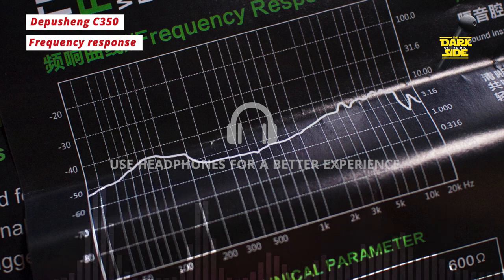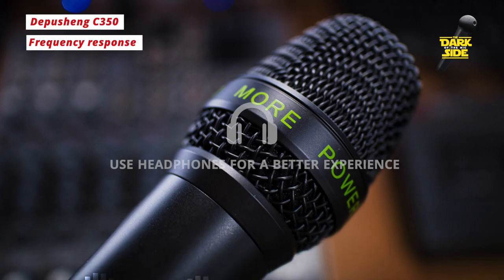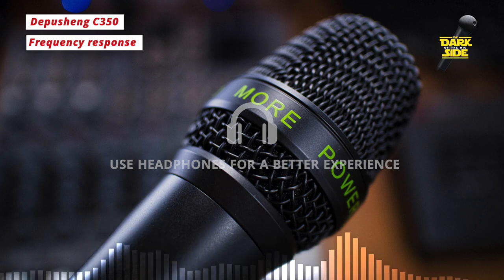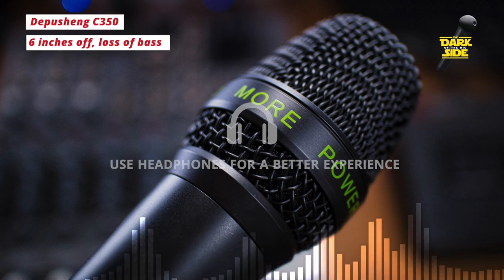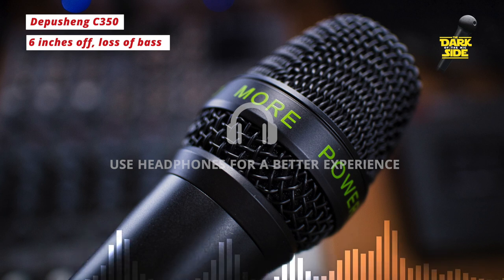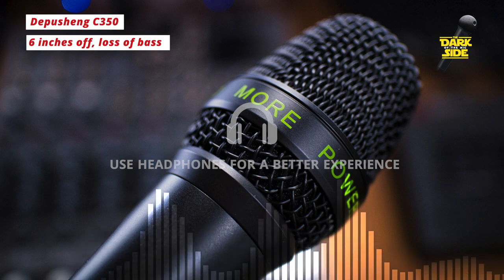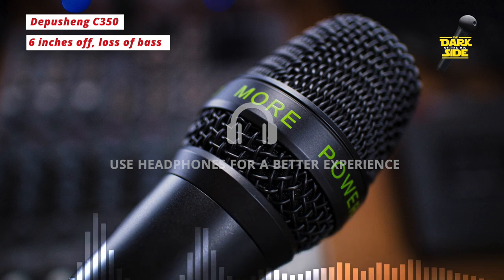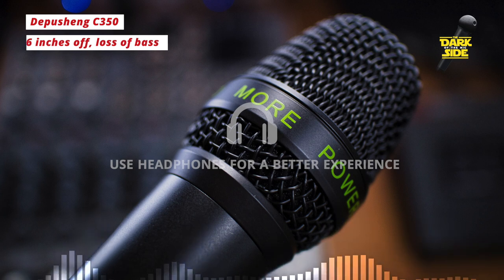At the moment I'm right on the mic, and to me it feels really quite tubby — really bloated in the low end and lacking articulation. But there's a fair bit of warmth there, so that's kind of good. When you go further away — if I move six inches off the mic — it becomes overly piercing and sibilant, especially in the high end. It sounds really quite thin. This is indicative of a lot of the mics coming out of China at the moment. They don't seem to find that natural balance between low end and high end to sound good out of the box.